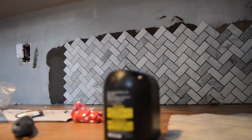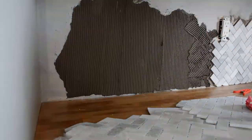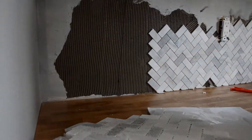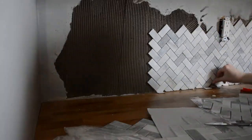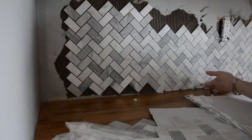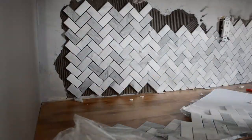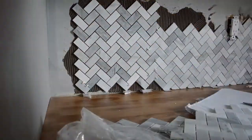Essentially, you take the straight part of your trowel, spread a bunch of thinset on the wall — at least enough to cover a square or two of your tiles — and then use the grooved side to make grooves which your tiles will grip into. The trowel size you use depends on the tile size, but read the box of tiles, which will often tell you which one to use. You're also going to want to have spacers handy to separate your tiles and maintain proper spacing between each sheet. I find that the cardboard the tile sheets come on works great as a spacer. I also use pieces of cardboard or spacers to hold underneath the tiles at the countertop edge, because you don't want your tiles right at the counter — you could get movement and potential issues in the future. The biggest hurdle with installing a backsplash is fighting against gravity, so spacers definitely come in handy.